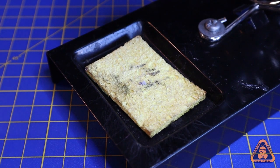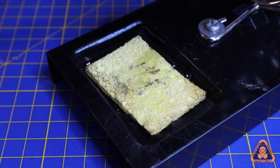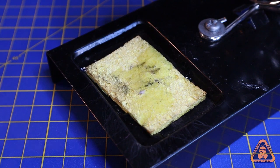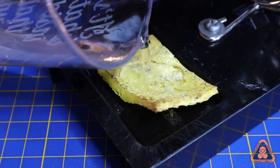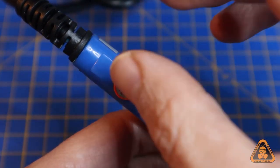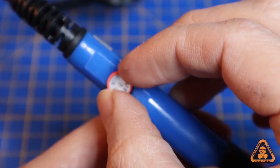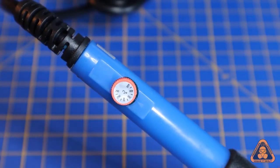If you're using a sponge to clean the soldering iron, add a little water for it to soak up and let it expand — this is where we'll wipe the tip clean as we go. Heat up the soldering iron; if it has a variable temperature dial, set it to 350°C or just over the melting point of solder wire.